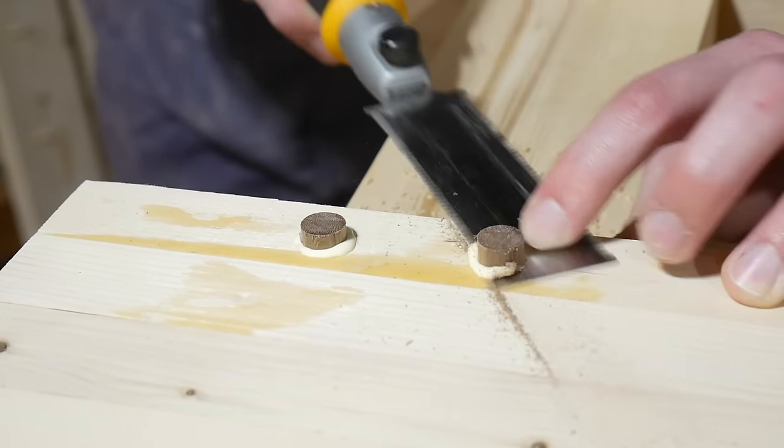So last minute, I decided to make a quick router sled and do this, basically slab flattening or benchtop flattening jig, where you clamp 2 boards parallel on the sides of the legs, use pieces of string corner to corner to make sure they're coplanar, and then you bring the sled with your router and you just slowly increase your cut depth until you're taking a full pass across all the surfaces of the top. And this took a little bit more time than I wanted to do, but it ended up really helping get that flat, and I was happy with the result.